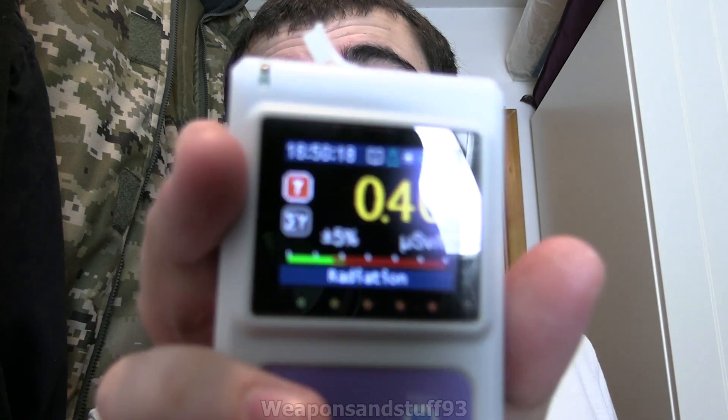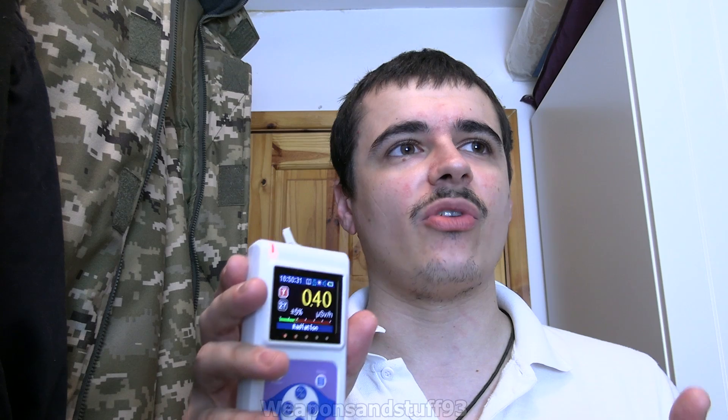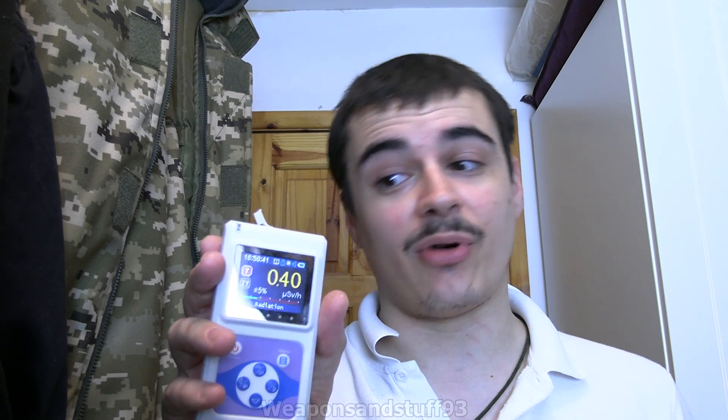You'll notice the background radiation appears a little bit high at the moment, simply because when I was measuring samples earlier I got a bit of contamination on it. I managed to get most of it off, but that's something I'll cover in the review — this is still one of those Geiger counters where it's quite easy to contaminate if you're measuring alpha sources, and fairly hard to decontaminate, especially with an alpha micro probe.